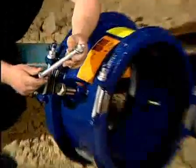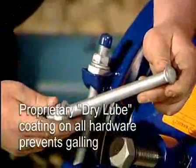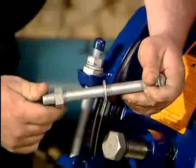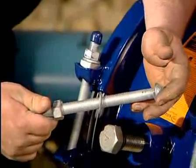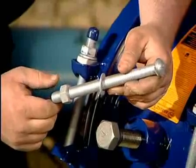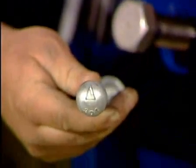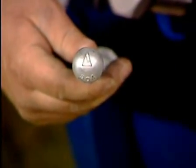One of the things we want to point out on the bolts on the HiMax is that all the 304 stainless steel bolts have an anti-seize or anti-galling preventative on the surface of them. We use a zinc impregnation that's mechanically imparted into the surface of the nut and bolt, which will allow for up to 100 cycles of tightening and untightening without any thread interference or galling on the stainless steel. We use that bolt coating process on the bolts that are under a draw load. All the bolts supplied with all of our products are 304 stainless steel, as you can see on the head of the bolt, which has been branded with the 304 designation.